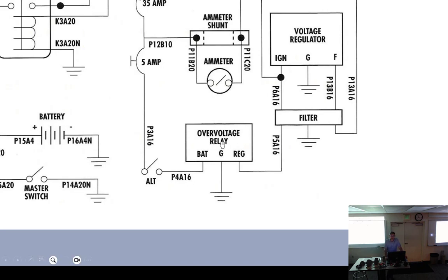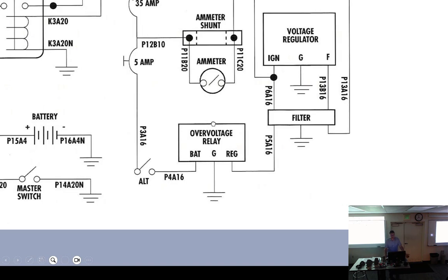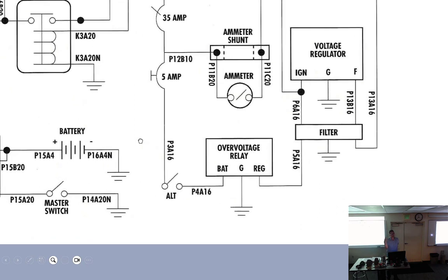Now, my aircraft, which Cessna does it a couple different ways. In my particular aircraft, the last two Cessnas I've owned, so maybe it's all of them, when you get in the aircraft and you turn on the master switch, there's an over voltage red light that comes on instantly. So I hit the master switch, I'm only running off battery voltage, and the light comes on, says over voltage. That's just the way they do it.